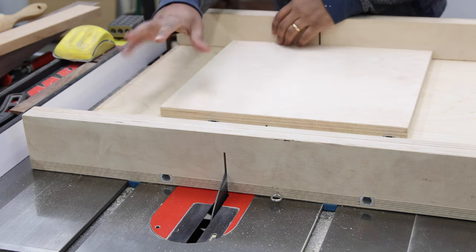This is probably the world's simplest stop block, but it's effective. It's basically a piece of wood that's really square — because I want to trust the squareness of it. Basically, we take a T-nut and put this in here. There's a little bit of wiggle room on purpose so I can push this down against the piece of wood. Then we put our little nut, push it down, tighten it up, and now this becomes a reference edge. If you need to reposition it, you just unscrew a little bit, move it around, push it down again, tighten it up, and you've got another reference edge to work with.